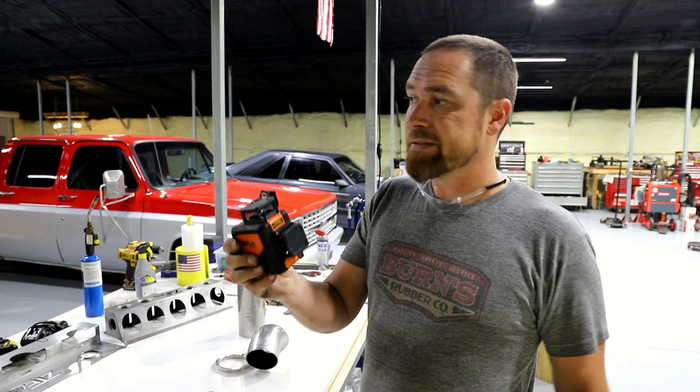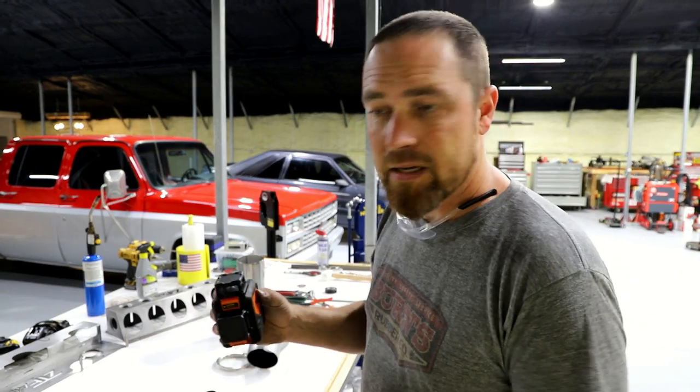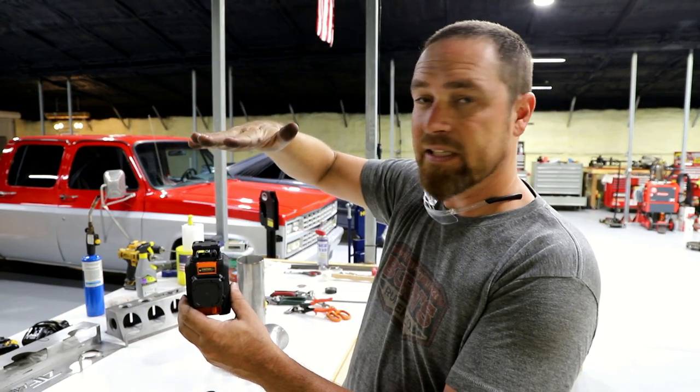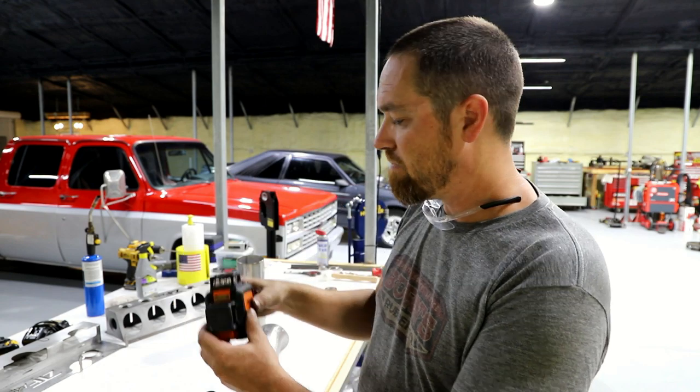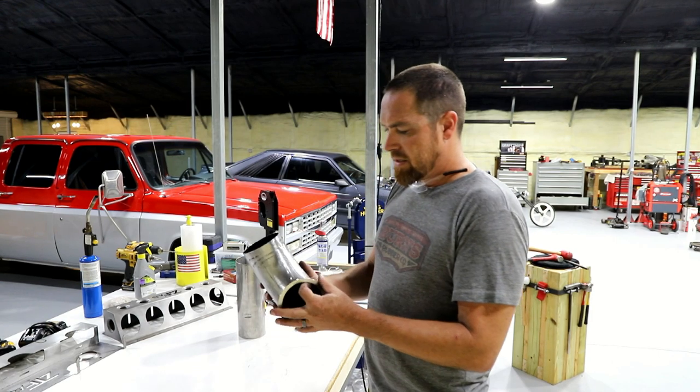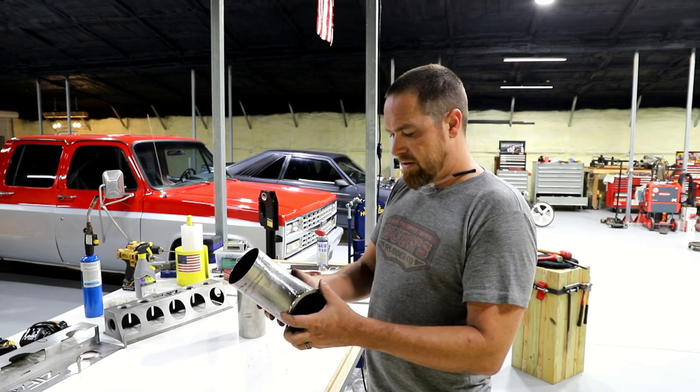I really like to have these things handy — they're self-leveling. These work great too for like if you're building a chassis on the floor and you want that thing to be perfectly level and you don't have a chassis table. You can set one of these things down, drop points, take measurements, and you've got a flat reference. It'll actually make a laser line 360 degrees and it levels itself. Anyway, now let's tack this stuff together and make sure it still fits. Let's do it.